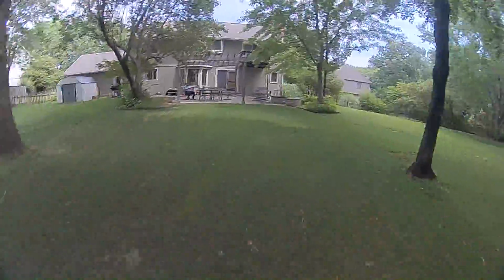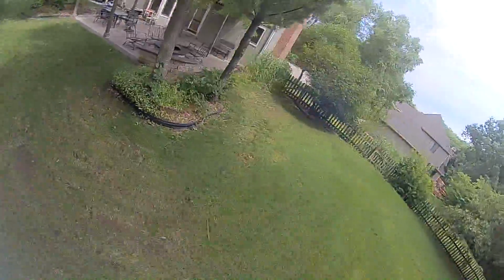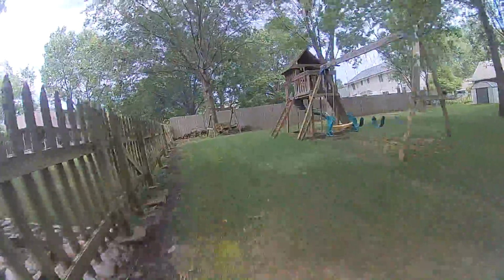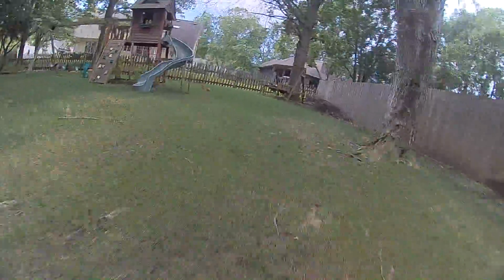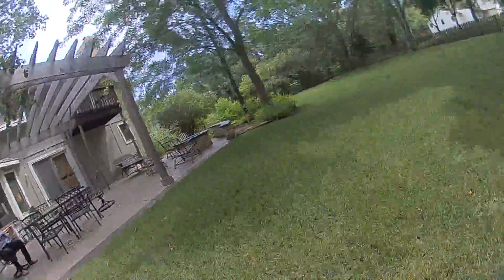get really steady footage. And when I look at this footage now as I'm watching it with you, I see a bit of jello, a bit of shimmer, and I think that's probably due to the fact that we have 3D printed parts in here. And I've found 3D printed parts to be a little bit problematic on these ultralights in general. You kind of have to hard mount everything in order to get them to really be stable, and then you have to have pretty good tune, otherwise you'll get a little bit of shudder or shimmer in your video.